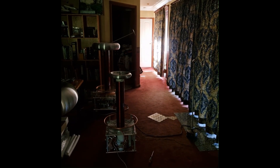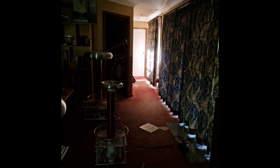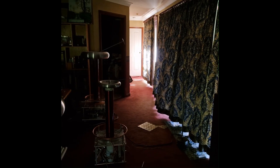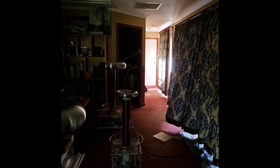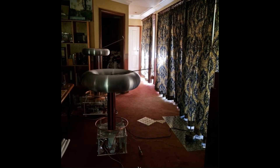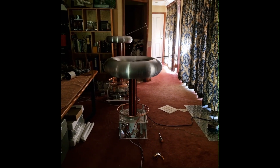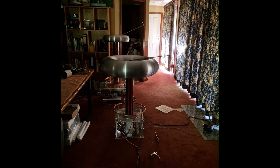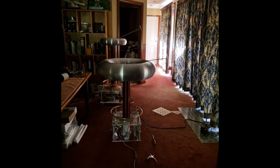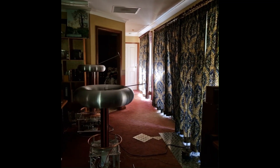Hard to see because of the light in the background, but definitely long discharges, about 50 centimeters long - very fine though. I'm going to change the top load back to the really big one and see how we go. The last test was with the really small toroid, and that was only with 100 nanofarads - I removed one of the parallel 100 nanofarad capacitors, reducing the 200 to 100, in order to get it to operate. Now the big top load is back on and I've tuned it, running on 200 nanofarad.